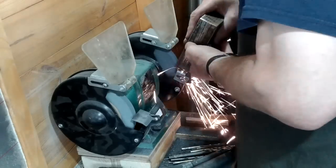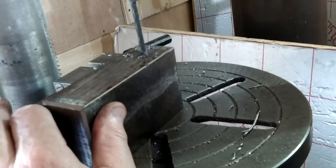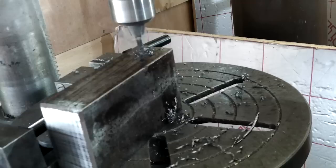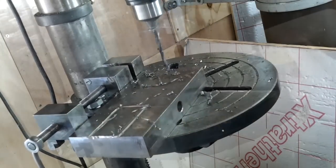With almost all of the sleeves and bushes completed, I've now started work on the main body. This is the upright post that will carry the indexing shaft when it's finished. But before I weld it to the main base plate, I'm going to rough drill and prep it for welding. The base plate is being slotted so that it can be bolted to the shaper.